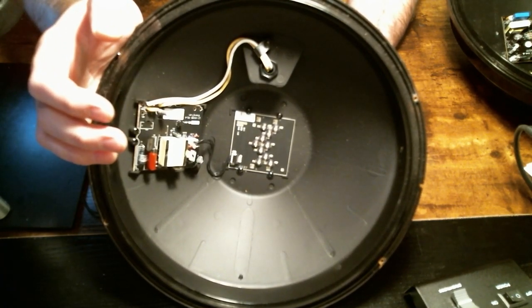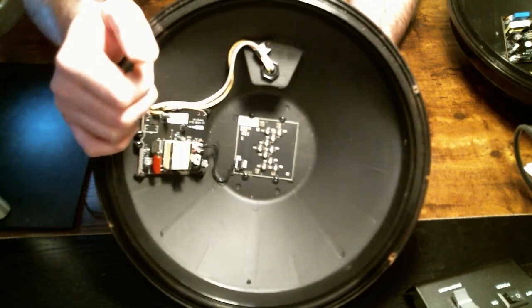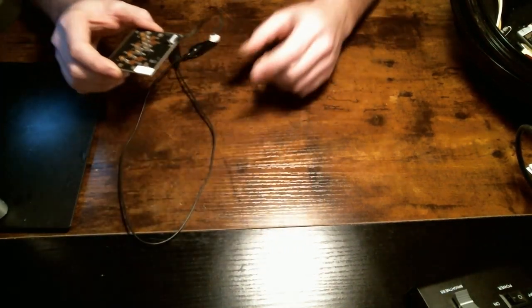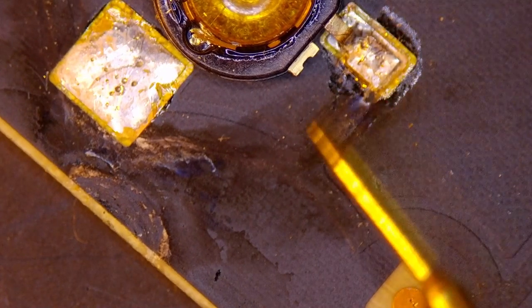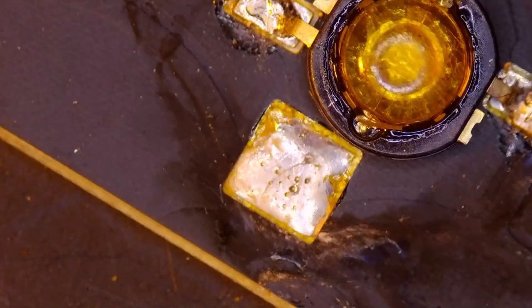What we're gonna do is get the voltmeter, put it in diode mode, and first test the LEDs to see if the issue is with the LEDs. I did a little preparation work and took one of the modules out already. We're gonna get right into it, put it underneath the microscope, and have a closer look. You can see the LED component right there — it's all over the board here. I see a little bit of a burn mark; you see how this is discolored and it looks like it's sort of sparked. On the back there appears to be some arcing on it — though that might be from the screws. But I do see some visual damage on the board at first glance.